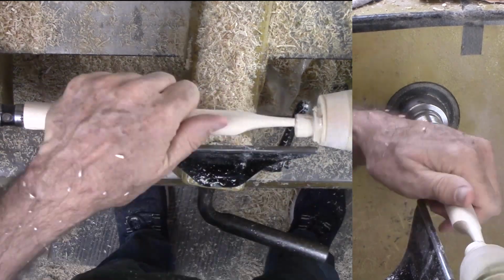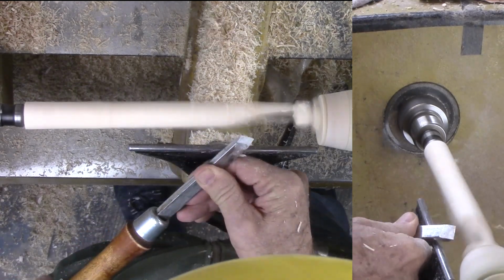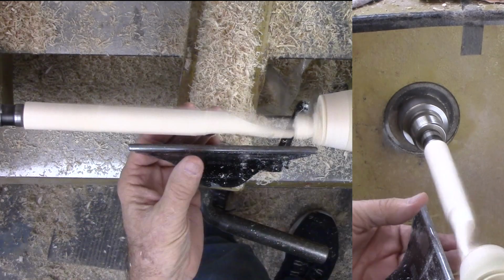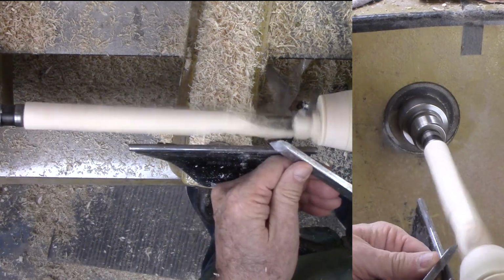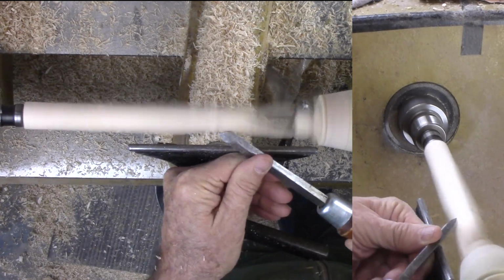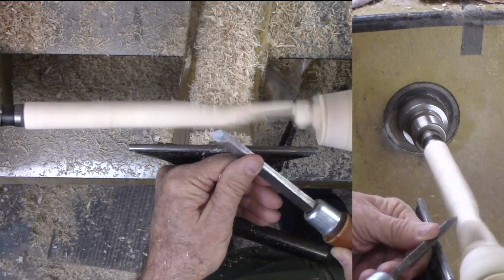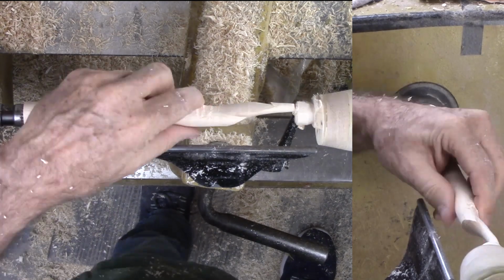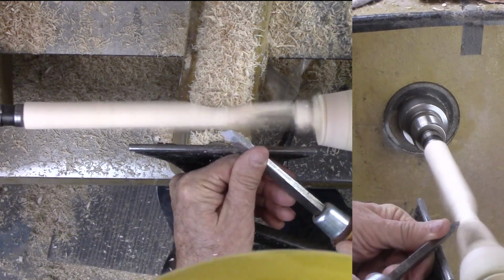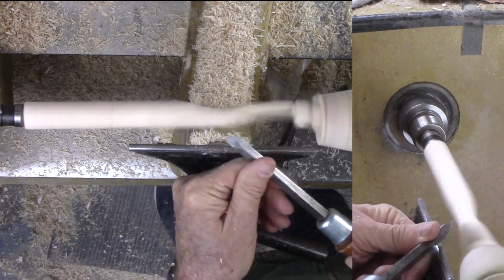Now I have shifted to the second offset hole. Again, with the wood out of round, the skew action is very gentle with the edge nearly vertical. In addition to a cove similar to the first one, I taper a little bit up from the first. I stop the lathe frequently to observe progress. I am observing the ghost image at the top of the spindle, but that is not enough.